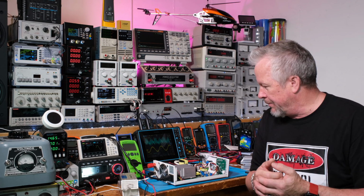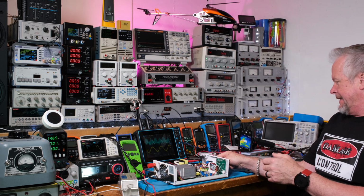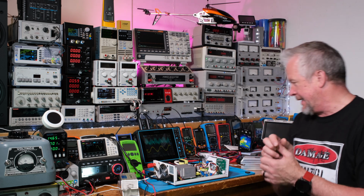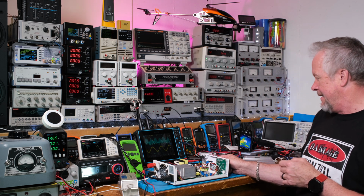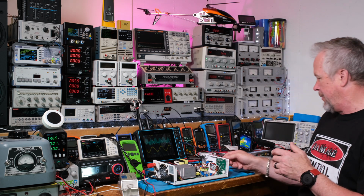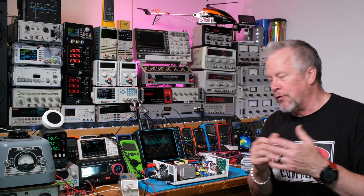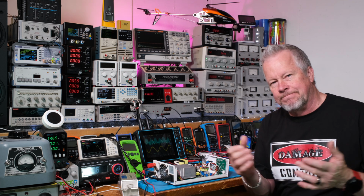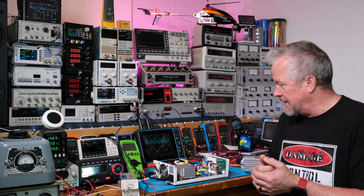This thing is really well designed, over designed as far as everything can handle all the power, because I've got 140 watts right now, so I guess I'm only about half power, but it's because I was up higher. Like I was up around 220 watts, I guess, and then I just turned it down because the resistors were getting so hot. So everything runs just so cool in this thing. Even at max power, they didn't really warm up that much more. So I'm going to turn it down, let things cool off. But yeah, I guess I could put a full load on there, right? I could tie all 4 resistors up to it and really load it down and do that. So maybe I should do that. But I just wanted to show you how it looks like this thing's so pretty well designed as far as the size of components.